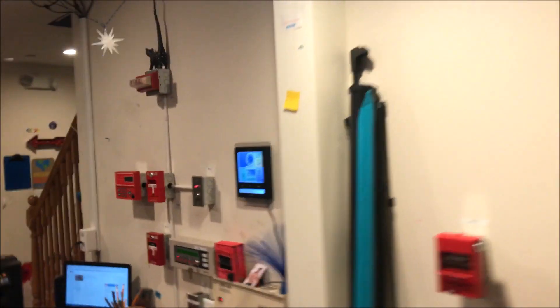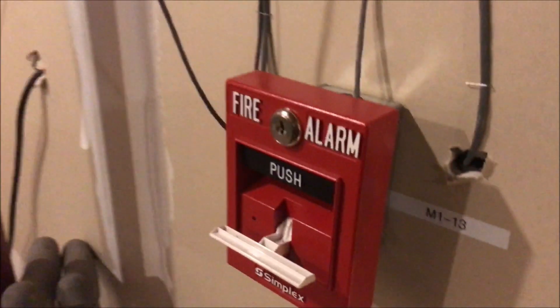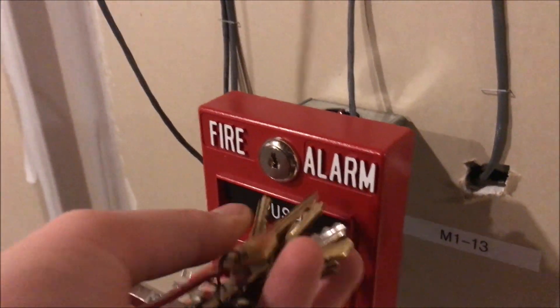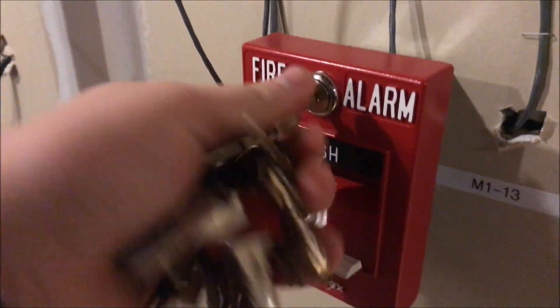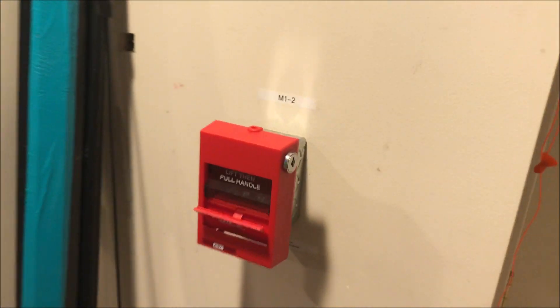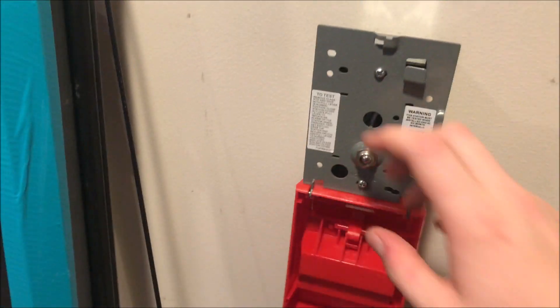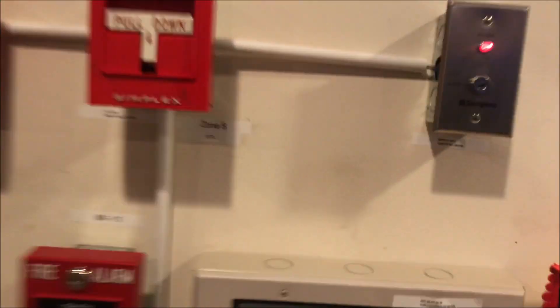We'll put a silence in the panel. That Genesis is my old Genesis with the lower tone version, which is why it sounds a little different. We're going to disable the door holder so we can put the door back open while I work in here. With the door holder disabled, even with the panel in alarm we can put the door back. Now let me reset this T-bar with my Cat 30 key, and then come over to the Edwards station with the Cat 45 key. There we go. We'll go ahead and reset the panel.